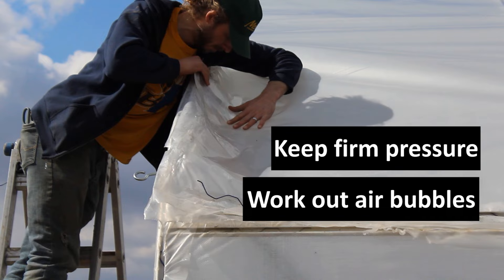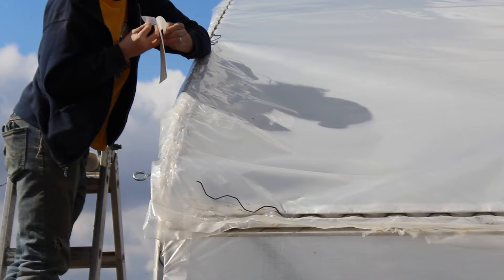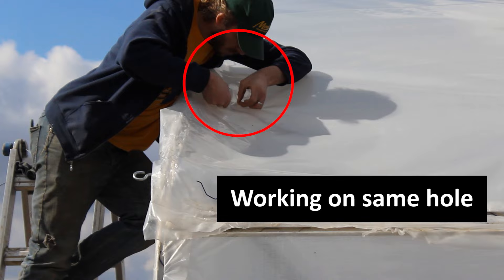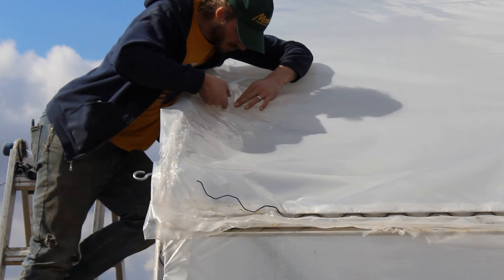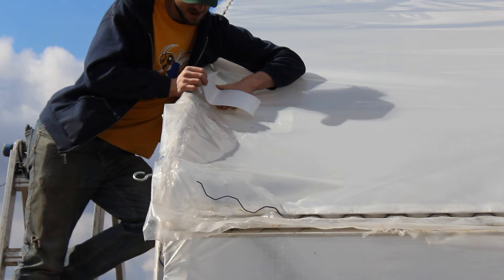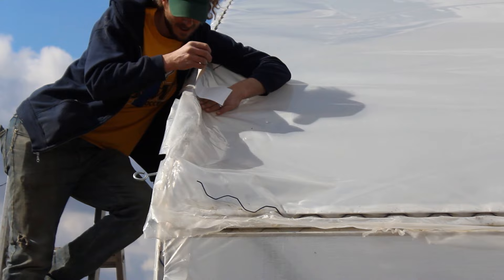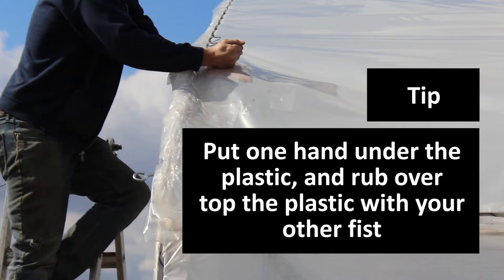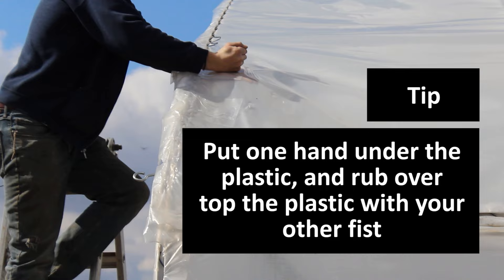I'm also trying to work out any of the bubbles that I can with pressure on the plastic. We cleaned the inside and outside of both layers of plastic, and we have to put tape on the inside and outside. Here I am on the exterior on the same hole I was just patching from the inside. The main reason is you want to have the sticky side of the tape on the exterior of the plastic pressed against the sticky side of the tape from the interior of the plastic. This creates double the adhesion and also reduces the likelihood that the tape will fail over time. Take note that I am removing the protective cover on the sticky side of the tape as I'm pressing it on the plastic. Once I have repair tape on both sides of the plastic, I do what I can to reduce any of the air bubbles. One tip: you can put your hand under one side of the plastic and rub with your palm on the other side. Getting out as many bubbles as you can is a good way to increase the lifespan of this repair tape.